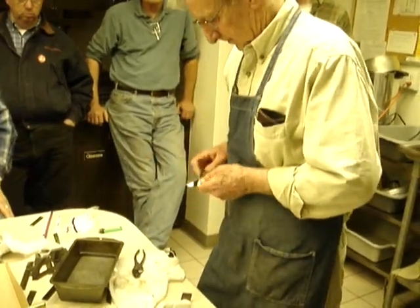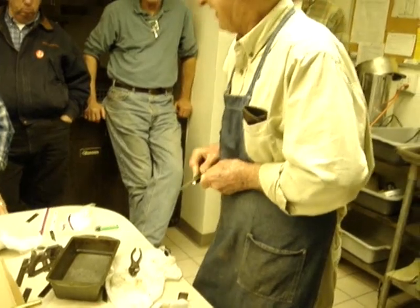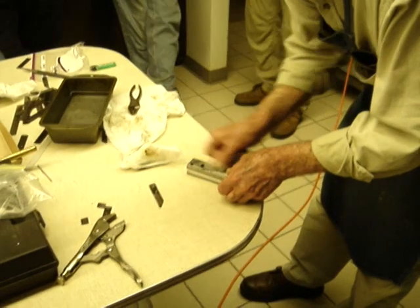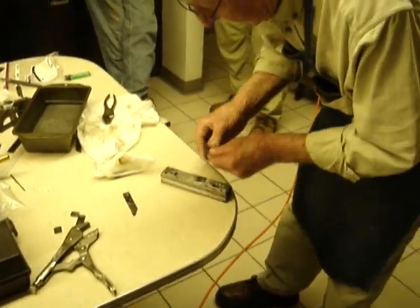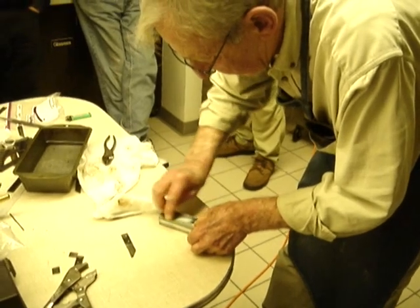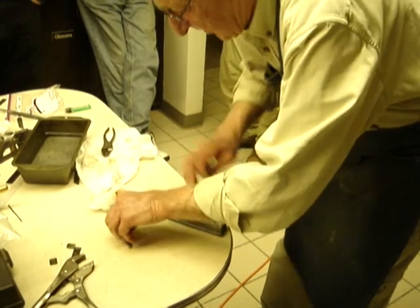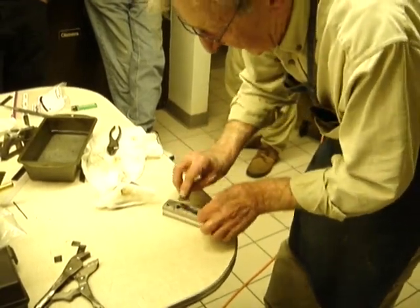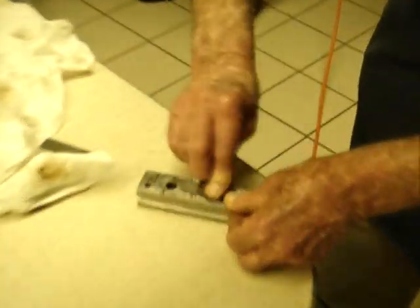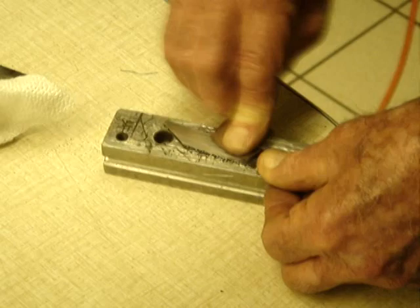See, that should zing almost. You get your blade heat treated. Then you're going to want to anneal it to draw some of that hardness out of it, and it stress relieves the blade, because when you heat treat it, you've got a lot of built-in stress in it.